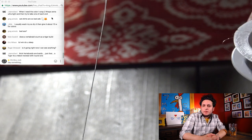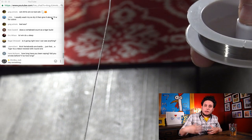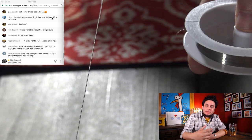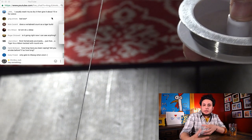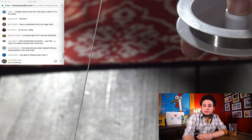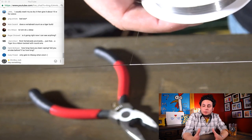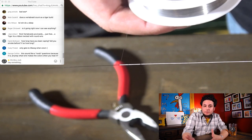And you want to make sure that it's all coming together clean. When I'm spooling this wire off the spool and onto that core wire, what I'm looking at is the shadow on the core wire, the way that it's coming together, the way that it's going onto the core wire. I'm looking at the density of those wires together. If it's too light in color, I can see that it's too spaced out. If it becomes darker very suddenly, I can see that it is backing up on itself, and I can find ways to correct that.